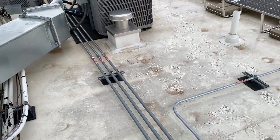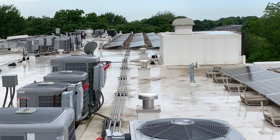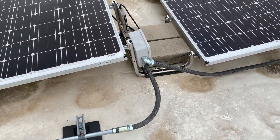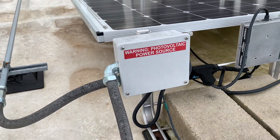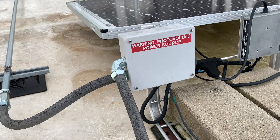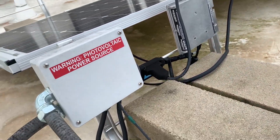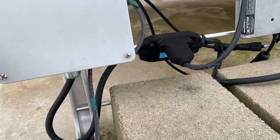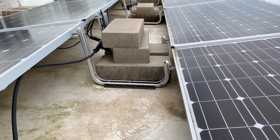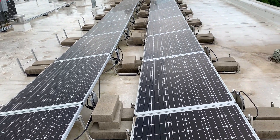Coming out of the bottom of that panel you can see the one-inch conduit runs with stickers on all the pipes every 10 feet. They head out to the far set of the array, but we're going to first look at the closer array to see the concept. Everything is stood off the roof with roof standoffs. Over each array there's a junction box where you can meet up with everything — a second seal-tight coming back out of that box just picks up the other set of panels. This little group is only 16 panels so it's only one circuit breaker picking them up. The grounding comes back out of that box as a number six ground — it just has to be lugged onto the system one time. Everything else is considered grounded because the system was designed and UL listed so that if you install it appropriately you don't have to run a ground to each individual panel.